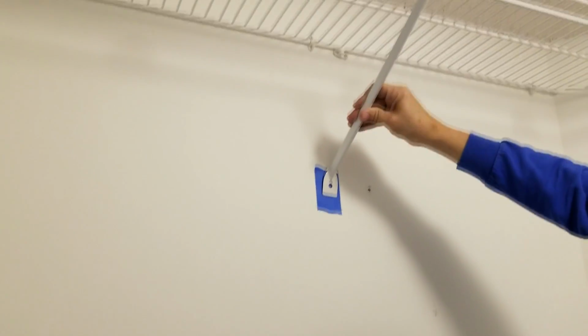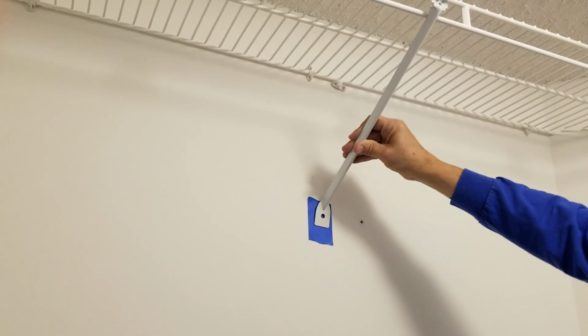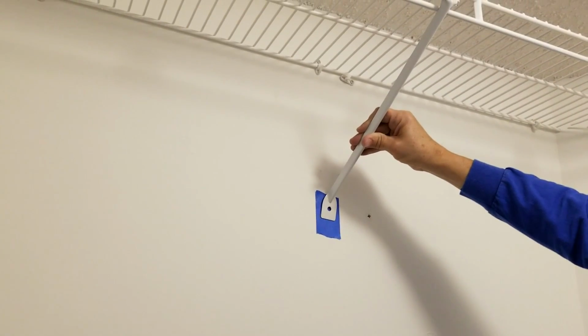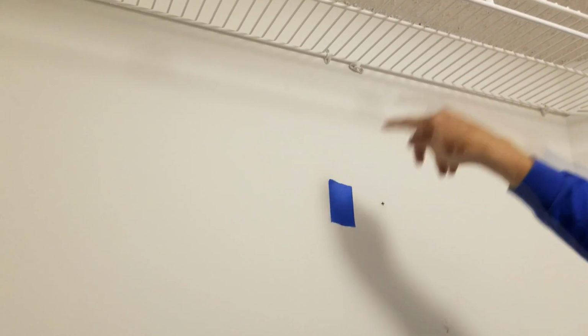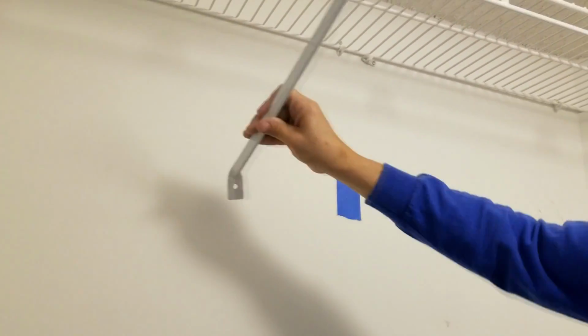You see that? Reliability. Okay, reliability boils down to just 3 inches. If this guy had just made the right decision, 3 inches to the left. And he would have saved the money on his little part there too. So that's why whenever I do this, I always do these through a stud. There's no reason to not find a stud and put one of these through the stud.